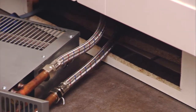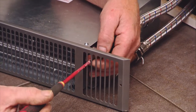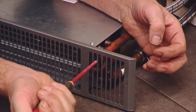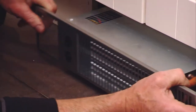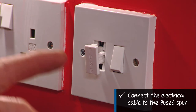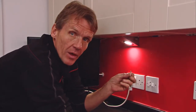We've got the plinth back in position and we're all connected up. I just like to undo the valve here to get any air out of the system — you can do this any time you like, but I like to do it before fitting because it proves I haven't forgotten to turn those isolating valves on. Then slide the whole thing back into position. Now there's one more very important thing: whenever a fused spur is supplied, it always comes with a 13 amp fuse, but the Space Saver has very low power consumption — all it needs is a 3 amp fuse, and it's important that you swap it over.